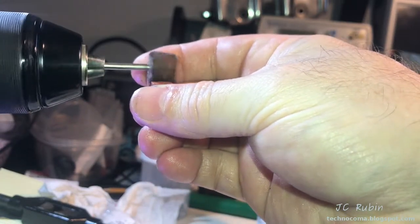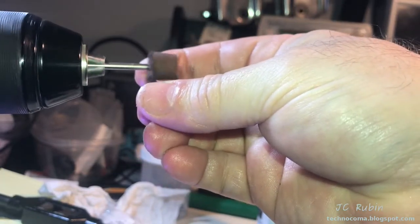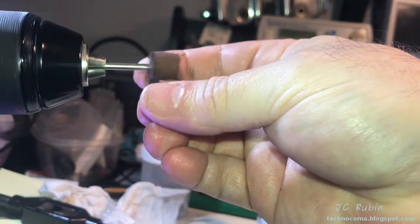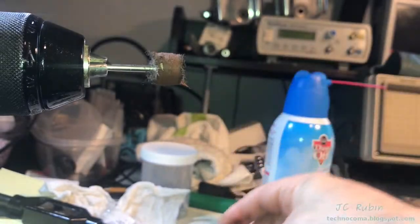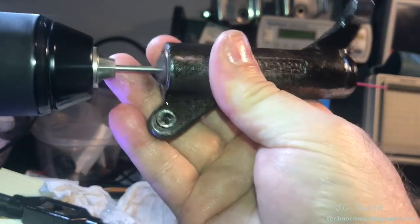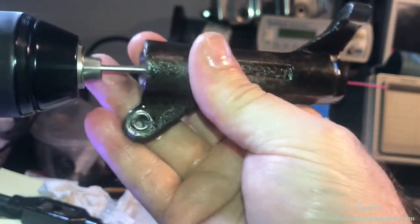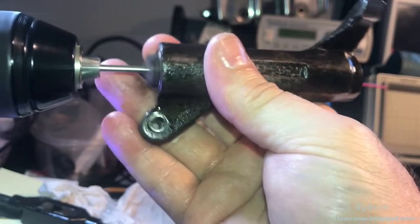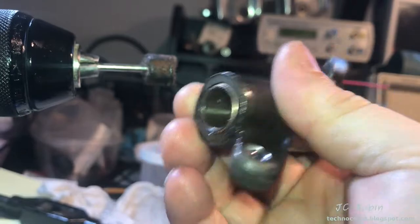I finish the surface off with some polish. I've made and sized this polishing wheel to be smaller so centrifugal force enlarges it when it's inside the bushing, trying to get an even polishing. If there was any slight unevenness from the wear of the reamer, this will knock those sections down to make everything fine. When I say uneven, I'm talking about astronomically small numbers.